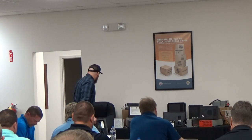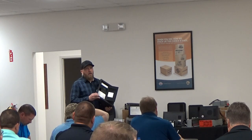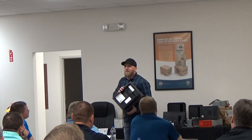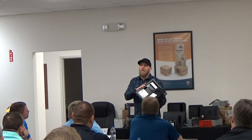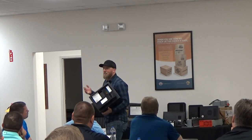Number 4 is converter trips shore power GFI. You're gonna hear this one a lot because a lot more people are installing GFCIs. I think they're becoming more standard in households, like the garage that they wanna plug into. All converters on the market, the way they operate, have the potential to trip a GFCI. There's nothing wrong with the converter. We don't recommend people plug into GFCI because it does have the potential of tripping them.